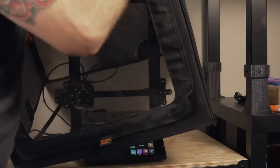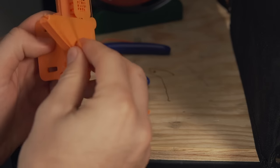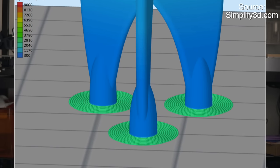Although I've only really used brims with higher temp or more warp-prone parts, I have seen people use them pretty effectively with materials like PLA or PETG. The usual application is a part that has a very small footprint — say you have a model that is kind of angled, small footprint, comes out at an angle, and is really top-heavy. Well, you could just hope your adhesion's good and make a silent prayer that it doesn't fall over, but having a brim will expand that surface area and give your part a better chance at succeeding and not tipping over. You'll have to decide which parts need them. For me personally, it's only been for higher temp and more warp-prone parts, but I've seen instances where there's just some crazy model that can't support itself and having a brim can really help to latch it down.